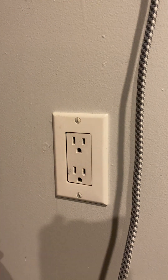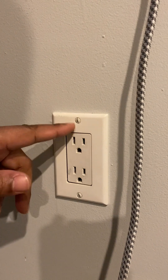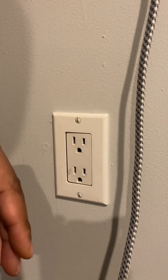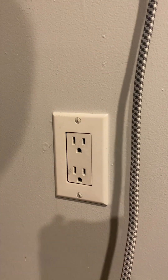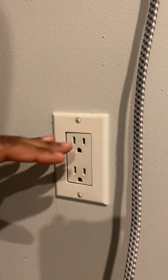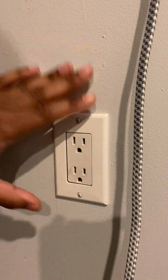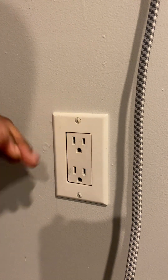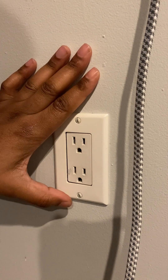Now I want to make sure I mention something as well: if you find that your outlet is giving good voltage or good output and you're still experiencing problems, and you know that your devices have good adapters and aren't faulty, and the wires aren't exposed or anything like that — then you want to go to your home's fuse box. Whichever room is associated with this socket, you want to disable that room at your home's fuse box, because you don't want to get hurt troubleshooting issues with this socket or taking it apart and checking to see if the wires back here are damaged or burned.